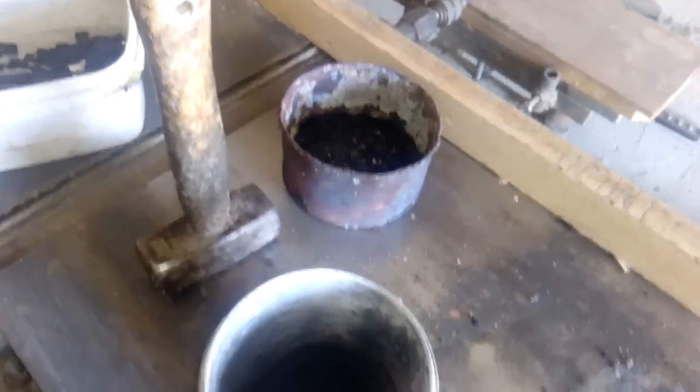So this is how it looks after burning - it's very crunchy. You have to grind that into fine dust. We grind that, crush that, and practically it's the same process as how we do with the IT chips. We filter that and it's a reverse - we keep the big part and we throw away the dust, because in the bigger part are our pins or plated pins.